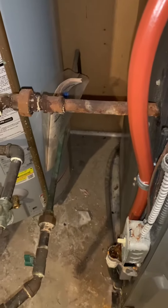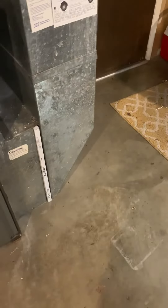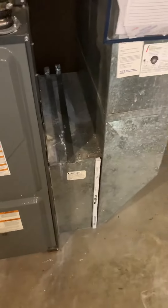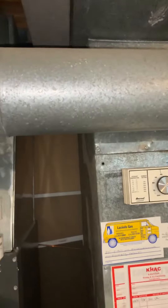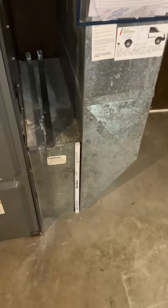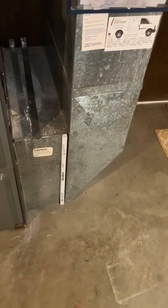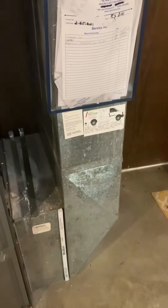The return drop is 10 by 24-and-a-half by 83 to the floor, and we've got an eight-inch spacer. We may be able to make up that difference with a canvas connector, or come right off this edge since the coil will remain where it is and the furnace isn't going to move. The filter is only seven inches, so we're looking at either scooting that over or making up the difference.